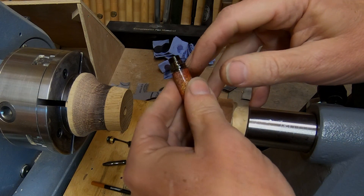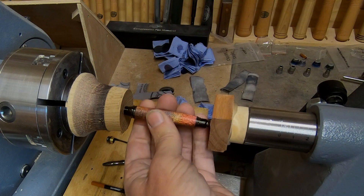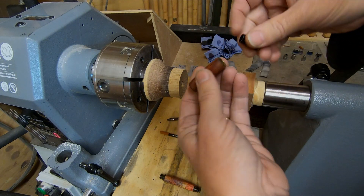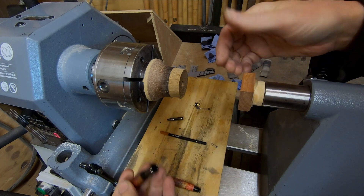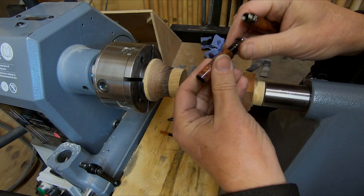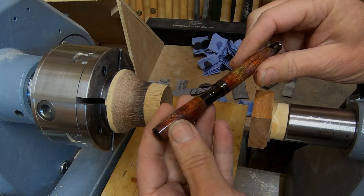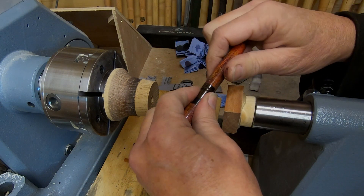I would always suggest laying out your pen kit to see how it needs to be assembled. For a two-part pen it doesn't make a difference which way around I do these. I locate the end, bring up my tailstock, lock it in place, wind it in slowly, and push it together for a perfect fit. Push it in partway, make sure there's no glue debris in there, then wind it in fully — and that one's assembled. For a screw-top two-part pen you need to work out precisely where you want the grain to line up.